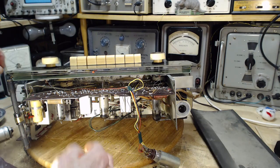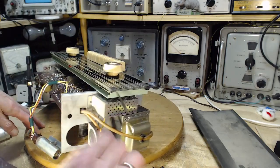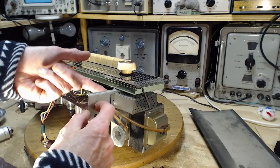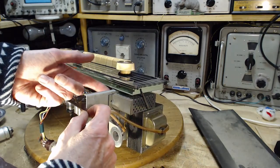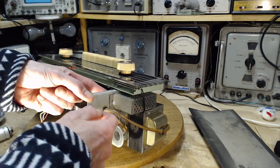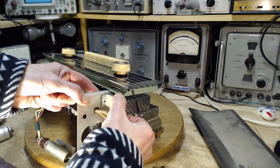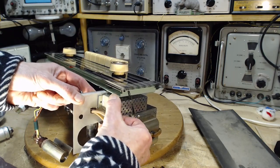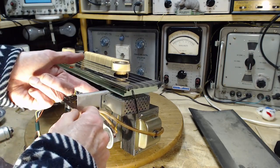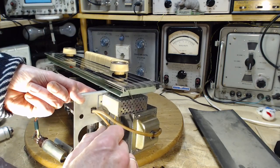In some cases, in a situation like this where you have a nut that's spinning on the back of the screw, like let's say here where I can show it, you can't get at the nut, just like the situation I'm in now. One of the things you can do is get everything turning and put tension into the connection. Like maybe stick something under here and apply a lot of tension. You can freeze the nut on the back from friction, and then you can manage to turn the screw.